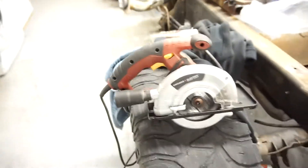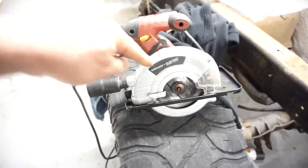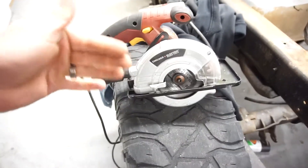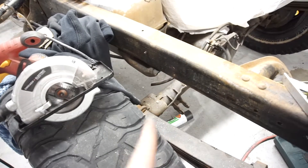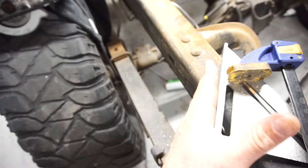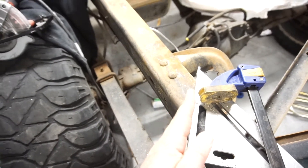That's pretty much all I have to say about this tool. If you're going to use it, I'd recommend some type of square, clamp, or straight edge, because every time it cuts it wants to kick sideways. When I had it up against the straight edge it kept wanting to travel to one side. I'd have to fight it and bring it back. I don't know if that's just the nature of the beast.